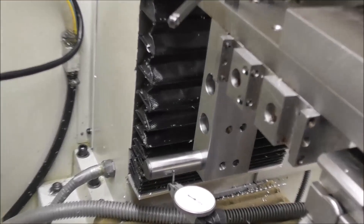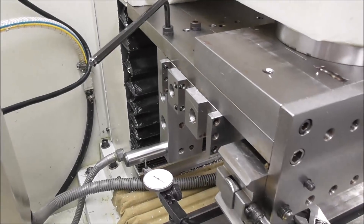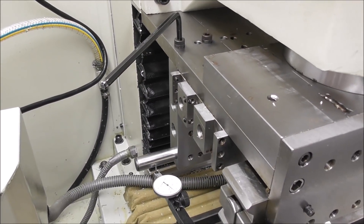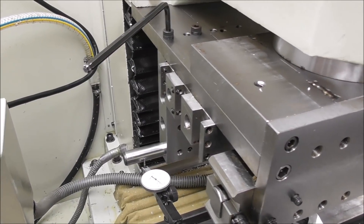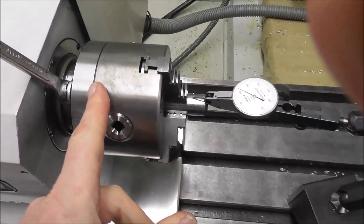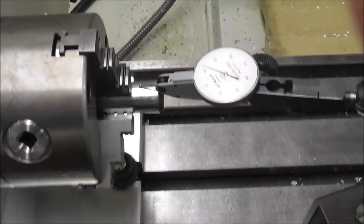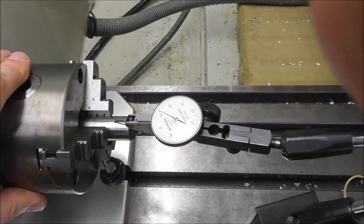I'm just putting in the back vertical post now. I've got it held in with two cap screws here — I haven't bothered to dowel it. It's really only a rough prototype, but it doesn't take a second to dial it in and tighten it up. If you wanted to make a really classy production model, you'd dowel that drop-down post for the three-quarter inch bores in place. In my earlier video series on Rapid Turn, I go into removing the spigot or giving it clearance between the back plate and the chuck, and fitting hexagon bolts so you can get at it with a spanner. Then you can dial in concentricity — it only takes literally half a minute and you can get your three-jaw chuck to be as accurate as a collet.